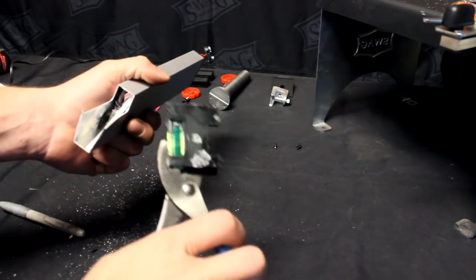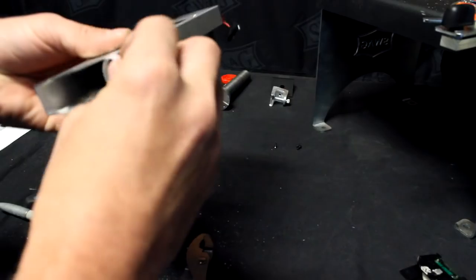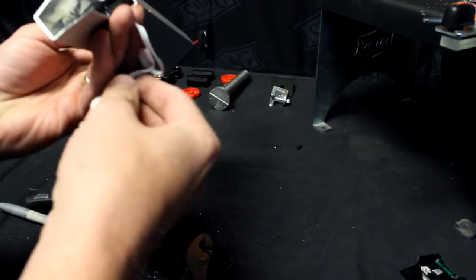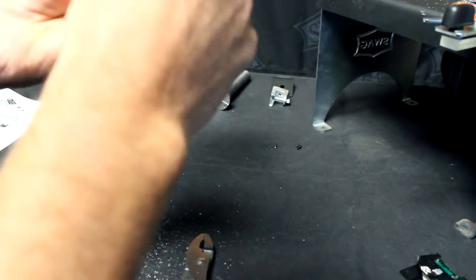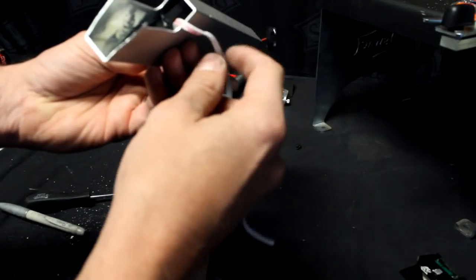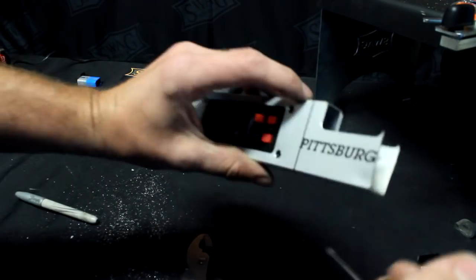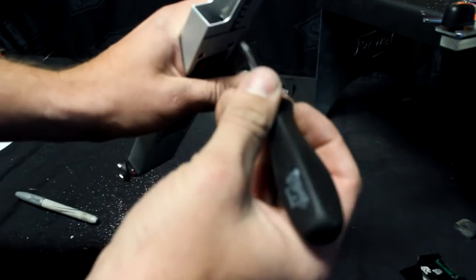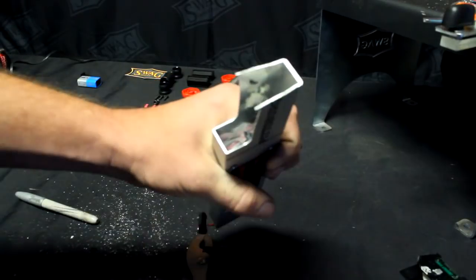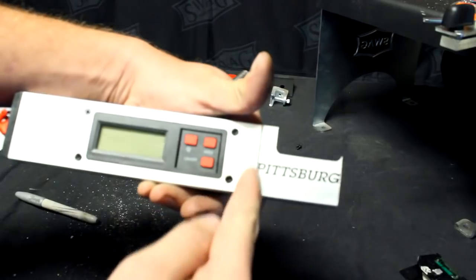If you've ever wondered what's inside of these — diesel fuel. Next step, we're going to take this wire and carefully unwind it so you don't rip the soldering connections off the back of the board. We're going to tuck it all the way back in there so that when we make this cut, we do not saw this wire in half. Take your time here to make sure it goes all the way down, out of harm's way. We need to make sure that everything is free of that cut line. Now we're going to pull out these two screws, pull out this black plastic housing from the aluminum body so we don't accidentally cut the wire and make it too short. Now we're going to bring back the band saw and cut that piece.